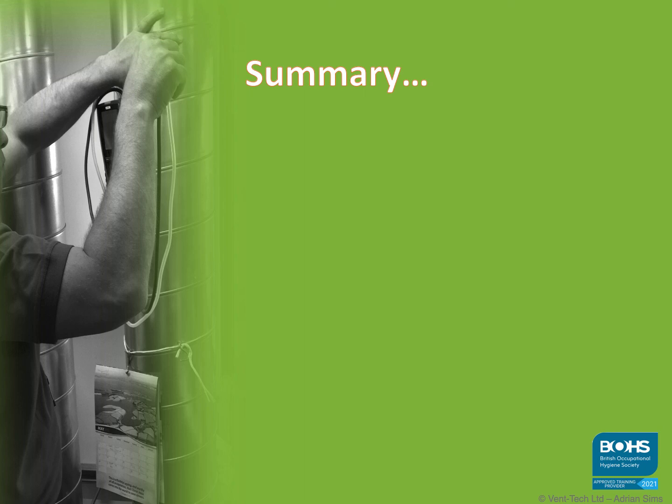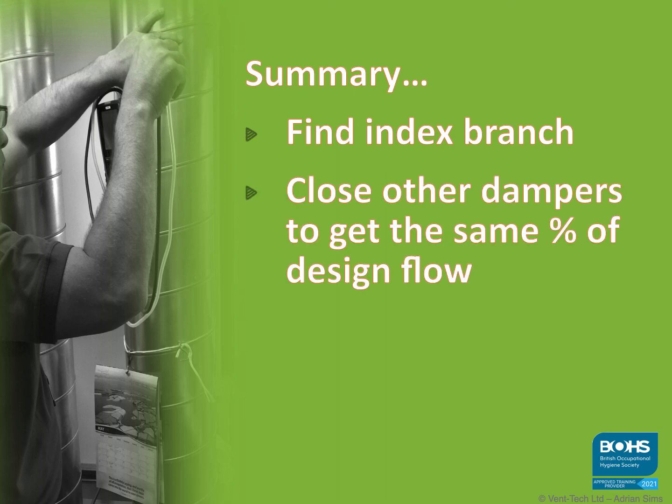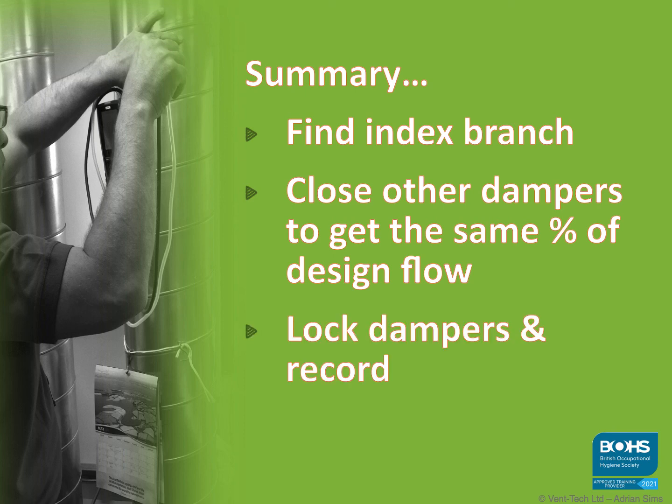So to summarise, proportional balancing requires you to find the index branch, which is the path with the highest pressure loss. You're then going to close all the other dampers down to get the same percentage of design flow as that in the index circuit or the index branch. Once you've balanced the system and they're all within an acceptable tolerance, you're then going to lock the dampers and record their position.